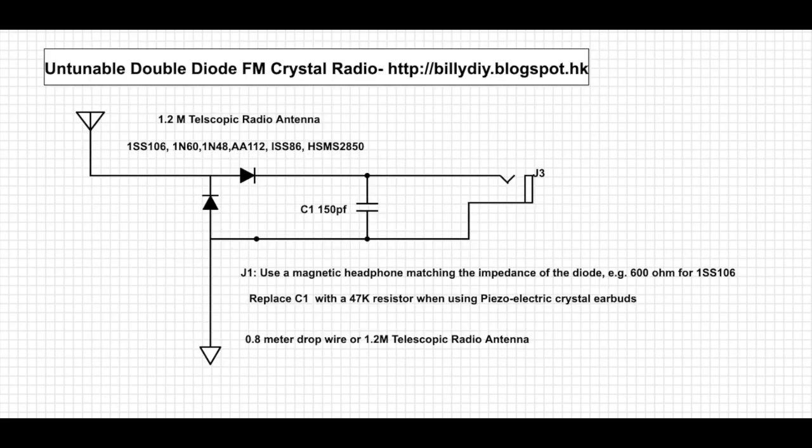The FM radio signals captured by the telescopic antenna and the loose wire form a dipole antenna. The signal will be detected using slope detection — which we'll discuss later — one of the methods to convert an FM modulated signal into an AM-like signal that can be detected using diodes. The two diodes arranged in opposite directions each handle one half of the wave, together creating the audio signal which is fed to C1. C1 filters out the high frequency signals through charging and discharging.